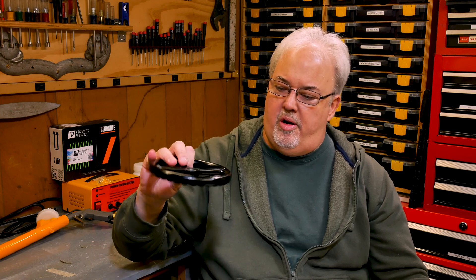I need a small paint booth with a filtered draft to suck the unused powder away. I also need a better way to hold the part in the oven — the plate I was using causes a shielding effect. They call it the Faraday effect, or a Faraday cage — it prevents the powder from getting everywhere. It really needs to hang from just a copper wire with a very small rack that doesn't interfere with anything. So it's an iterative process — I'll make some changes and hopefully we get better in the future.